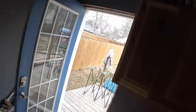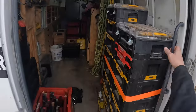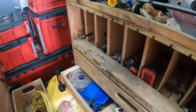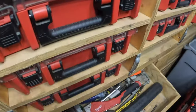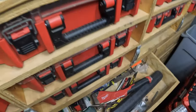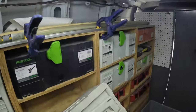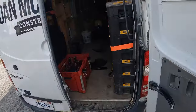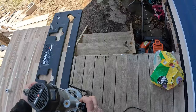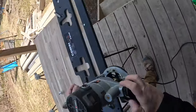This countertop came from Lowe's — it's the Allen and Roth. I didn't really like it; I thought it was pretty low quality. There's a lot of exposed finger joints on the edges and it doesn't really have much of a roundover. The butcher blocks I've done in the past were from Menards and they were better quality — I was surprised. These Allen and Roth butcher blocks are kind of junk. They're not flat, and I even had a little bit of trouble with alignment in the corners.